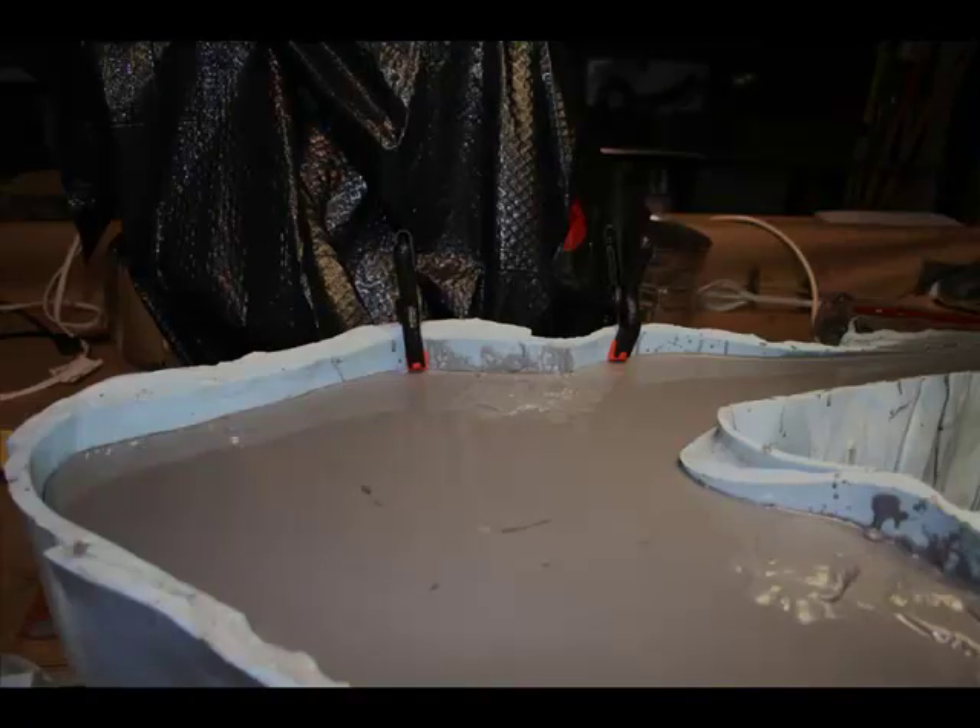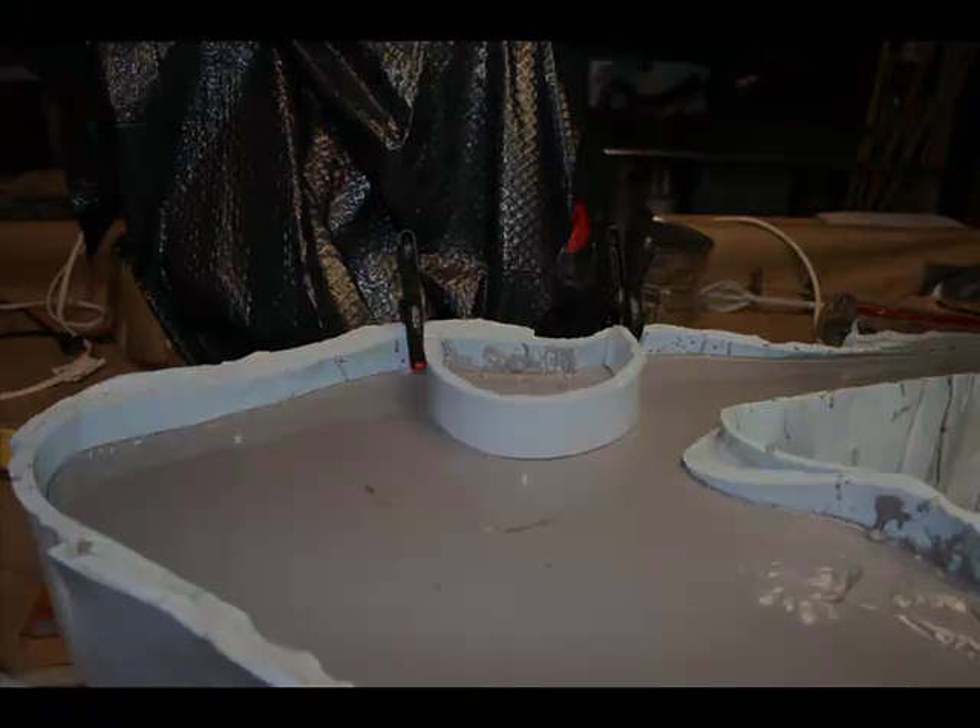The mold is filled, but you notice there are two islands from the registration surface that didn't get covered well enough. This is the seat-of-the-pants fix: I made horseshoe dams over those two areas and poured a very thin coat of resin just to seal them. Once the seal set, I filled up the dam, and it took care of the problem.